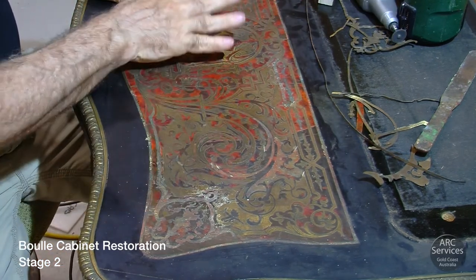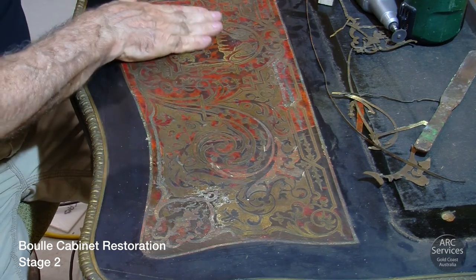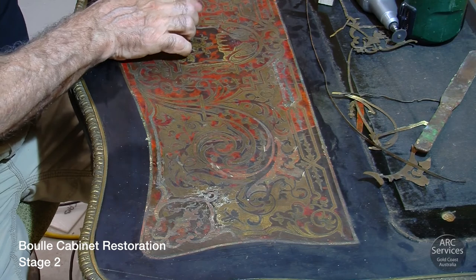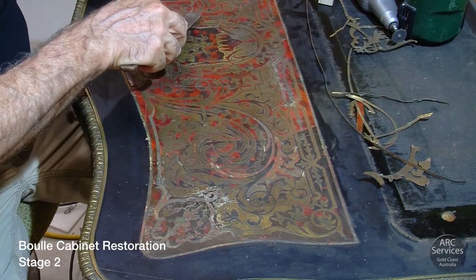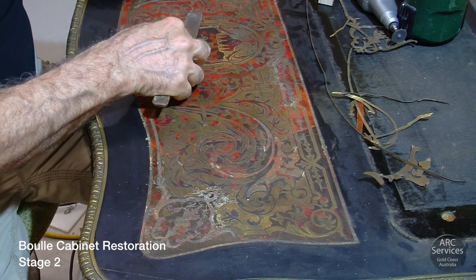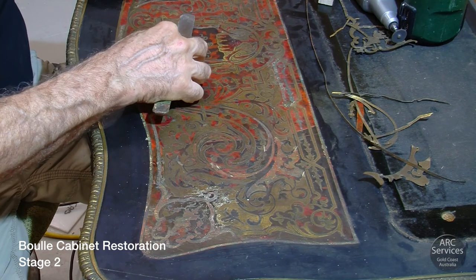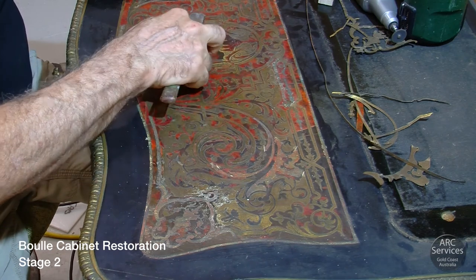Curiously, as I heat that with the grinder, there's a slight smell of urine, and apparently urine was used to hold back the gelling time of the animal glue, which is a bit unpleasant. I think it used to be referred to as maiden's water, as the addition.